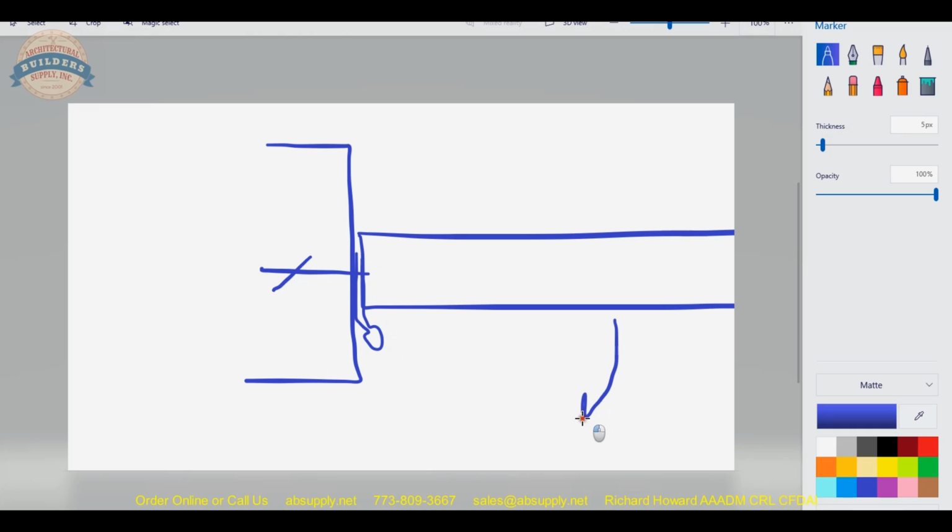All the mechanics of how the door operates are still the same. The fact that the vertical axis of pivoting is here and not basically here doesn't change the net width of the door, doesn't change how the door swings, doesn't change the requirement of clearance between the edge of the door and frame. The only thing that it would very, very slightly modify is when you are templating hardware. A lot of hardware is margined off the vertical axis of pivoting of the hinge, and that's where that dimension is taken from.